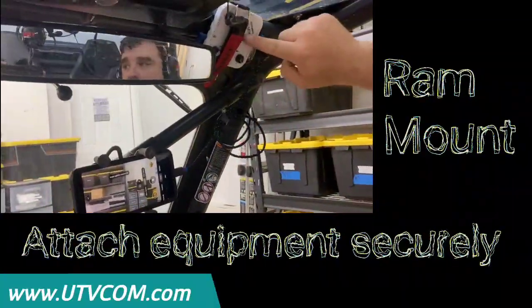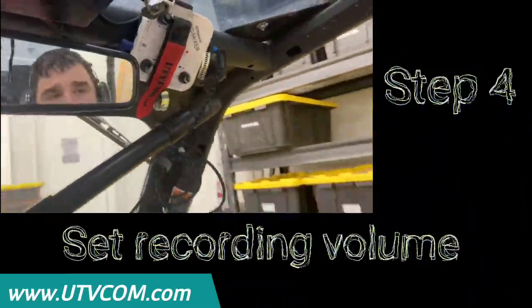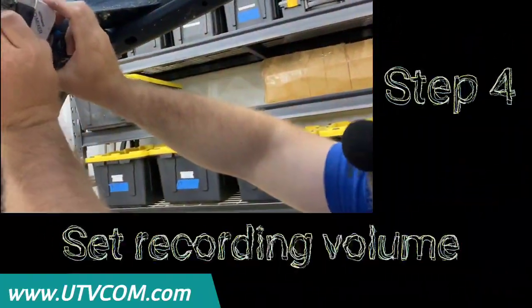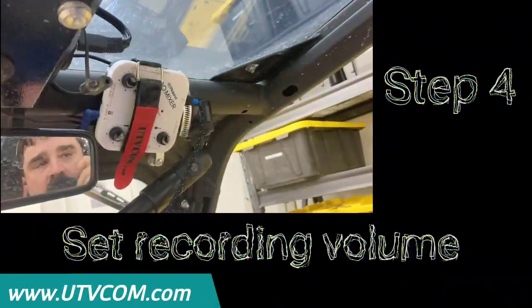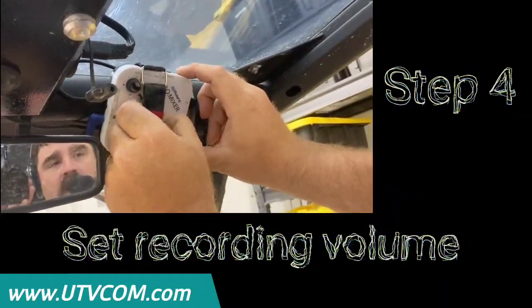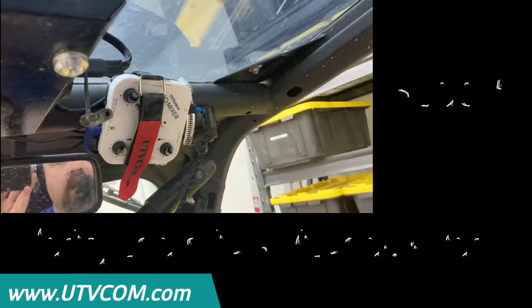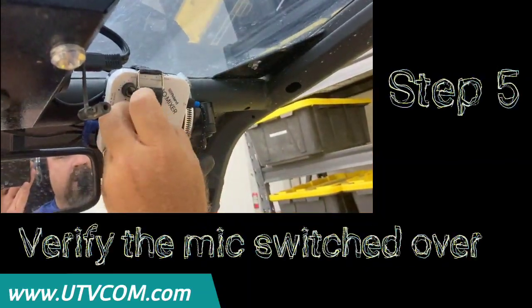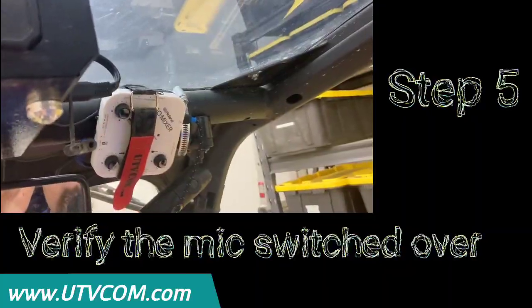now you see, if you go look at this mixer right here, when I talk into here, see how that light's getting red. You don't want that peak light to be on. So you turn this center dial down so that when you talk in it, that peak is not appearing. If I turn it up too loud, it will appear again. Whoa. Oh, now it's not working. Let me see. How about now? There we go. So I've got to just turn that thing down, and there we go. It's right below that peak thing.